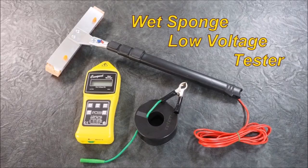The wet sponge unit is a very simple instrument. It has three voltage ranges. You simply wet the sponge, clip on the earth, pass the damp wet sponge over the surface, and any flaws that have the substrate exposed will show as a beep and an alarm, allowing you to identify exactly where that flaw is.